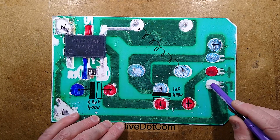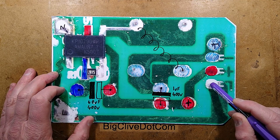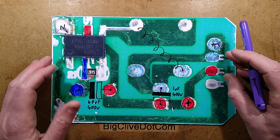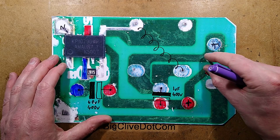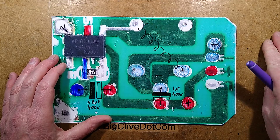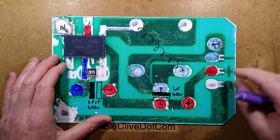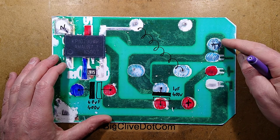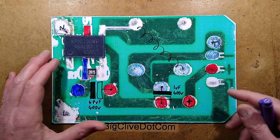These four pins here, one of which is connected to live - I get the feeling this design has been repurposed, and that this is probably designed to work with a fluorescent fitting type tube, where the LED replacements have live and neutral coming from one end and going back along as the positive and negative. The other end passes the live and neutral along, and then it comes back as DC to the LEDs. In which case this circuit board would have been slightly bigger, this pad would have been separate for neutral, going back along and over. That's just a guess though.